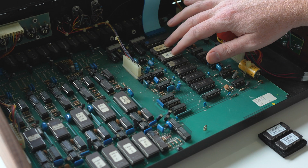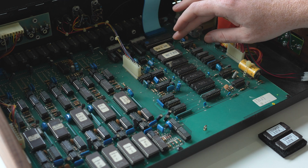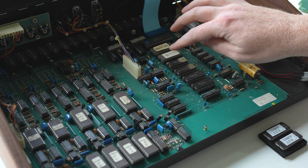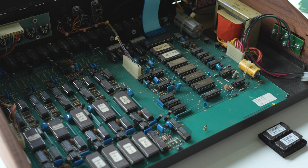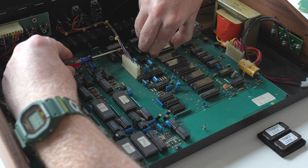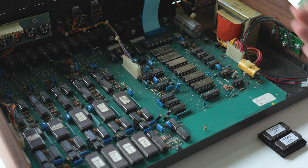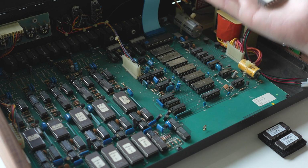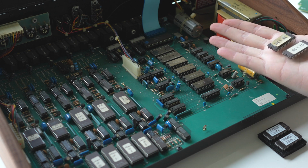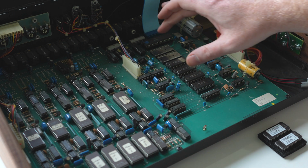So first you want to get these two chips out, which you can pry gently with a screwdriver underneath the main body of the chip and then not on the socket that it's in, and pry them up and just kind of work each side a little bit until it gets loose. And there we go. We got these two out here. First step, a little bit trickier than expected. So take your time, be careful. The first one I did popped right out, so you got to be careful. And now for this last big boy.